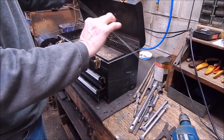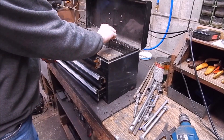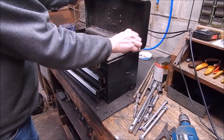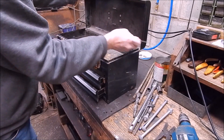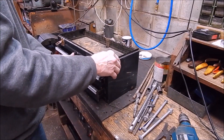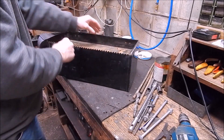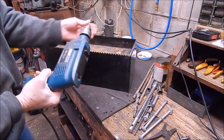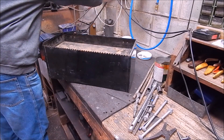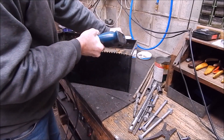Anyway, we'll get back to the old toolbox. To take these apart, all you do is open her up - there's a strip of steel with a big hinge that goes through the back. You just knock that part way through and then pull it out with a pair of pliers. Make sure the drawers are apart when you do this. Once you've taken the pivot pin out you just lift the lid off - and the lid's off. Now we take off the latches - we don't want those. Just get a drill bit bigger than the hole and drill the ends off.